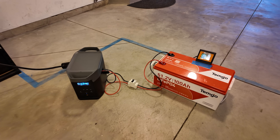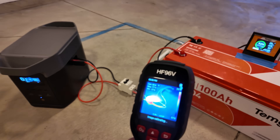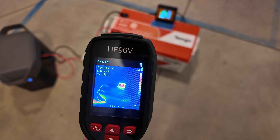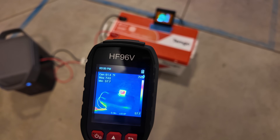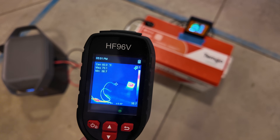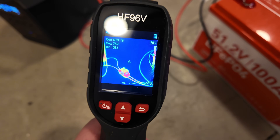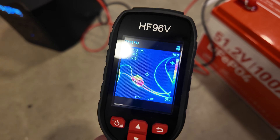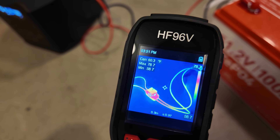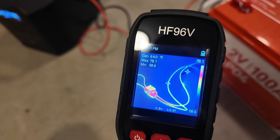This has been running now for about 20 minutes at full tilt, almost 1,500 watts. And I've got a thermal camera right here. Let's first take a look at the battery. The hottest thing is the screen, which is funny — it's registering at a whopping 74 degrees. Connections are cold, cold, cold — registering like 60 degrees on those. These are Fahrenheit temperatures, by the way. The thermal camera makes the breaker look blazing hot compared to everything else, but in reality the hot spot on that is a whopping 78 degrees. So colder than your skin by 20 degrees — nice and cool.